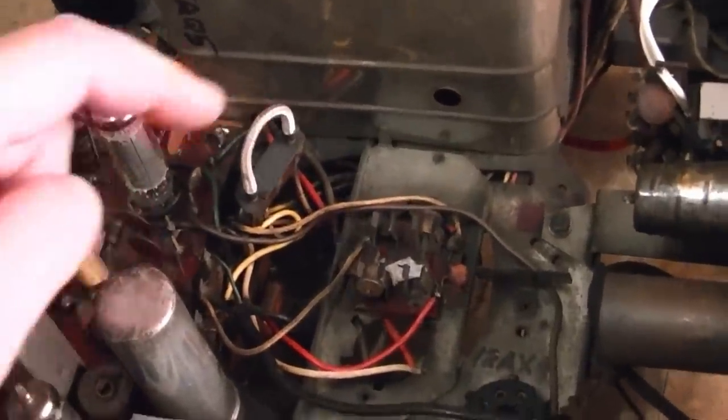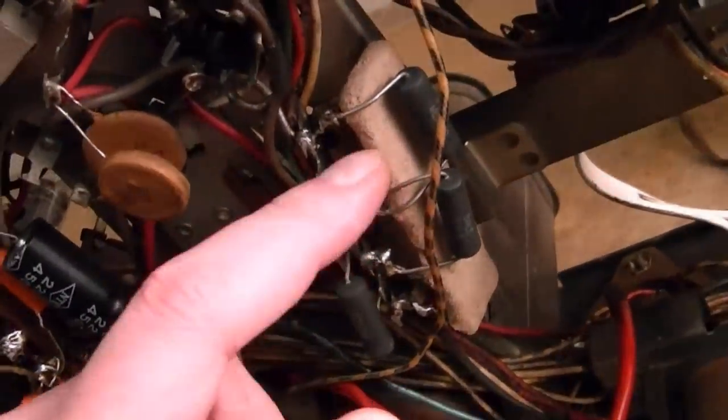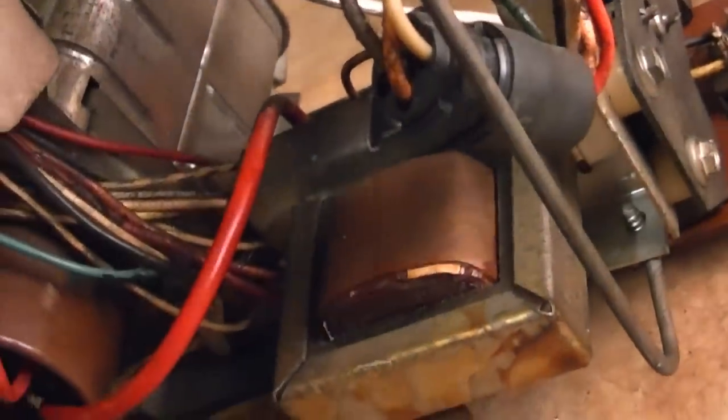This one still has the original fusible resistor, and as I recall underneath there's still a thermistor — it's been replaced though; the original probably went out at some point. I better double-check that cold resistance and make sure it's an appropriate replacement. Somebody's already replaced these power resistor sections, but they left the old one in — seems like a really bad idea. It's wired in parallel with the new one. Those old sections could start conducting again, which could increase current flow and possibly burn out the tubes or at least shorten their lives. So I'll be cleaning up that junk. Also, the wattage rating doesn't look quite high enough. That's a 10 ohm — I know that's not right.